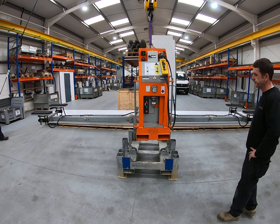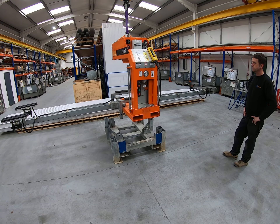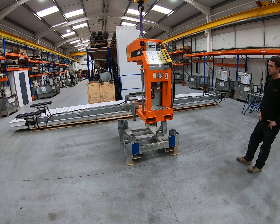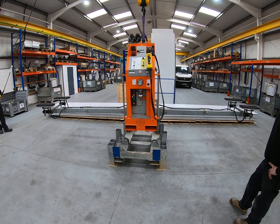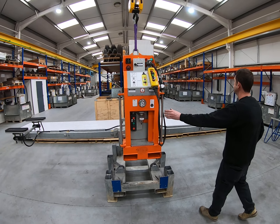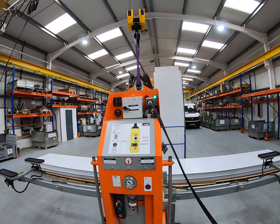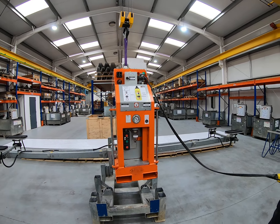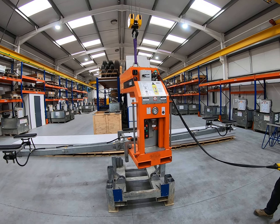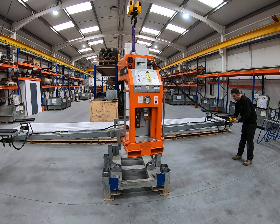As those buttons are pressed you may hear a valve closing. Now what's happening is the vacuum pumps are running and emptying the vacuum reservoir on the machine — that could take anything from 10, 15, or even 20 seconds. The red light went out and the audible warning stopped, but you can still hear the vacuum pump running. You'll notice the green suction light has come on. The vacuum pump is designed to kick in and out as needed to top up vacuum levels throughout the day.